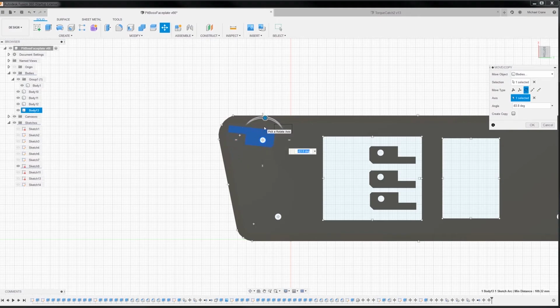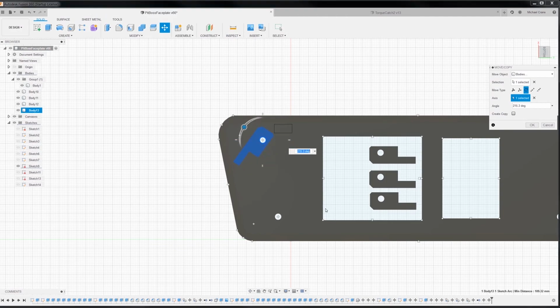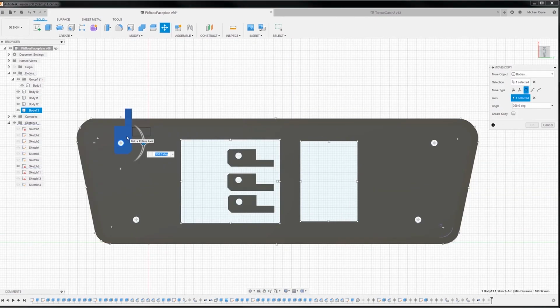Yeah, so when you're tightening it, righty-tighty, lefty-loosey, let me back up. When you install this thing, these torque stops will be somewhere in this area right here, all right? And you'll pop this guy in there, and then when you go to tighten it up, it's going to go up like that and hit that stop right there, right? And this little piece right here is going to catch the edge of the cutout for the controller, right? And you'll have 4 of them holding all corners basically in, right? And this will be very tight, right? This should work really good. I'm curious to see how it's going to work out, but I'm very confident this will work.